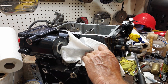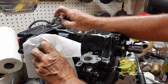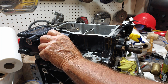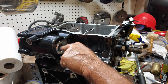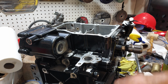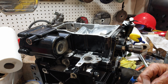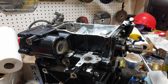Hydraulic pump. And the only bad thing about this is that there is an O-ring that seals on this face that is not in the parts list, which is a bummer because I would like to replace it. It's kind of grody. There's a snap ring in here that holds back a bearing that goes in there, and then the hydraulic pump shaft goes into that bearing. When all the parts came from LS, I labeled what they all go to. So, silicone grease, O-ring grease.